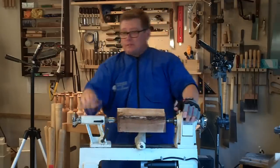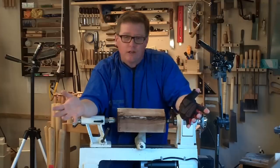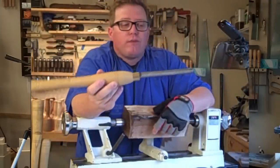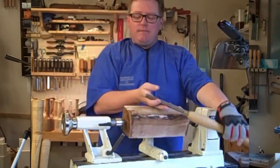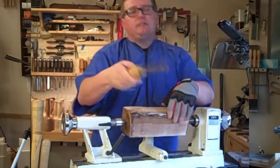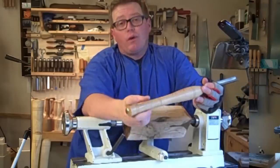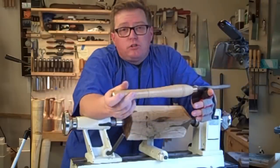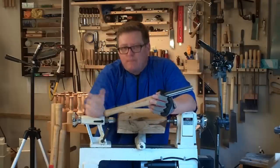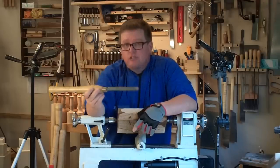One of the key aspects of woodturning is something you learned in elementary school — riding the seesaws. This tool is called a roughing gouge. It has a deep U to it and a single bevel that goes all the way across. This is the tool we use to go from basically a log or a square like I have right here to round. The principle for using this is the same principle you'll use for every single other tool, except when doing a scraping cut.